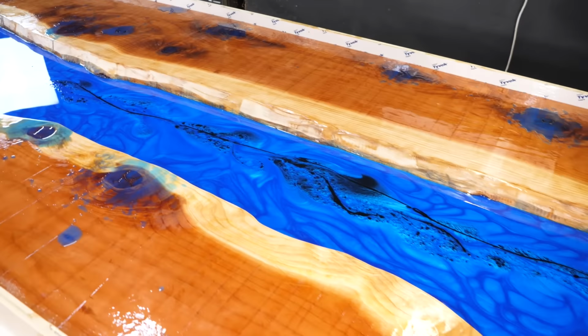I start out with probably 60 grit, 120, 220, and now let's cut our piece. Remember, I had my table a little oversized, and I'm going to have to do this a little bit hokey here. I do not have the luxury of having a beautiful Festool track saw, so I made my own with some clamps and two 8-foot levels, baby. Where there's a will, there is a way. You don't need any fancy equipment to get these jobs done.